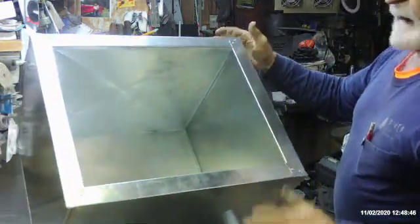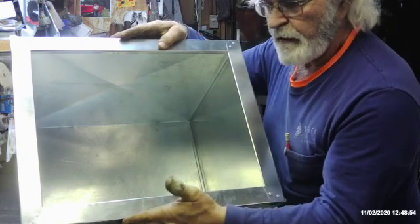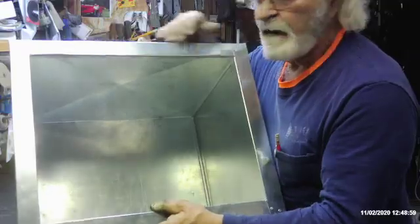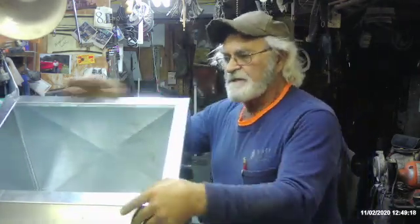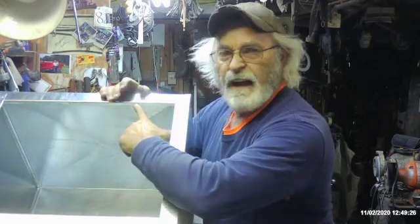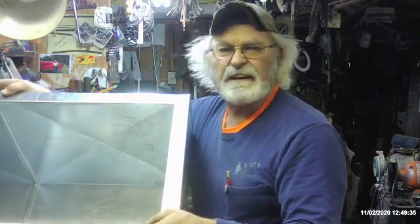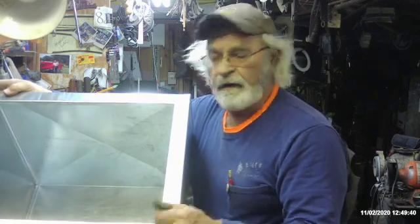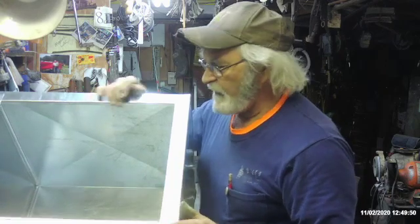There we go — nice and secure, that's a good steady base. We'll put a lining of Armaflex tape all the way around the perimeter, set the furnace in place, clip it to this right here, and then we'll be ready to cut and put the return air into the side of it. You can see it didn't make a bad box at all — it's really secure, it's not going to give anywhere. In the last video I made a box I used scrap pieces and made 45-degree angles — a 90 with a 45 across — riveted in all four corners. That was for a larger three and a half ton furnace with more weight. This little two-ton unit only weighed about 60 pounds — I picked it up with one hand. So this is good to go. Hope you all enjoyed that — this is Tractor Man 44 and I am out of here.